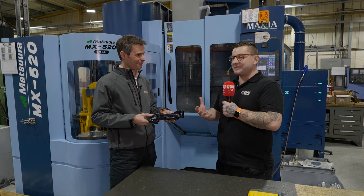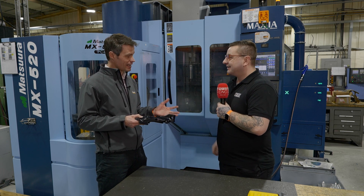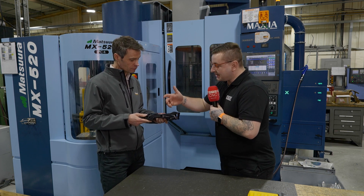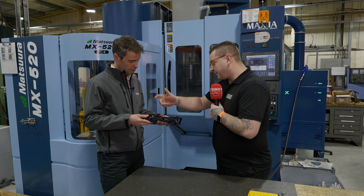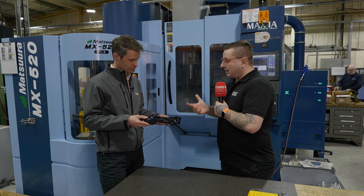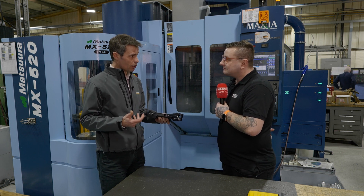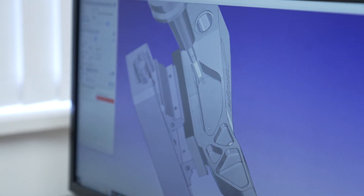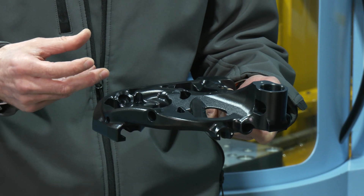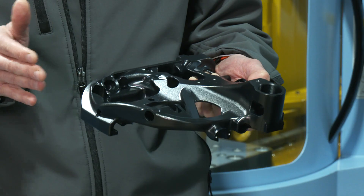In my own experience there's nothing worse than having such a nice part and then having little cusps or burrs to try and file off after — and that's exactly what that minimises. Now on this part there's quite a lot of radii and quite a lot of awkward toolpaths. Is there something that will show me that my tool can get in where I need to finish? We do have a model compare so you can see what you've cut and what's left. We have a three-axis and a five-axis rework cycle — with rework you can put down any toolpath layout you want, so for aesthetic purposes if you wanted it to flow a certain way, you can allow it to flow a certain way.